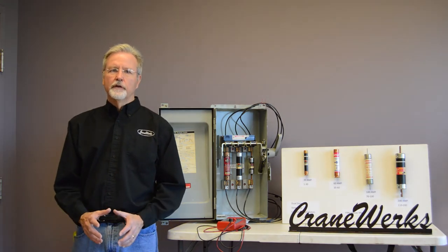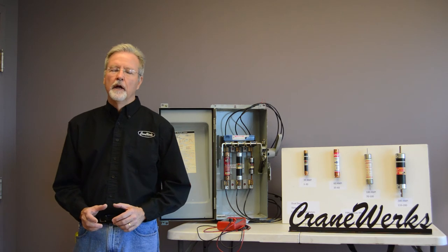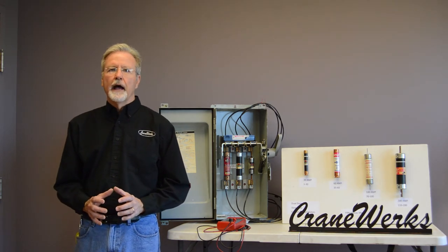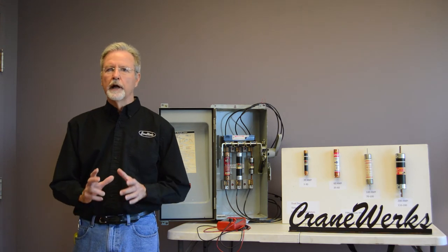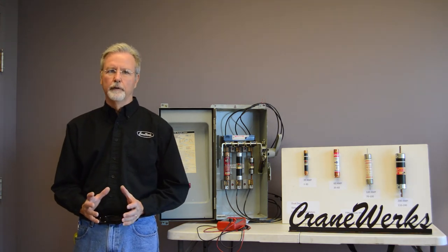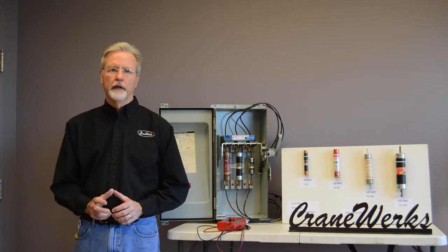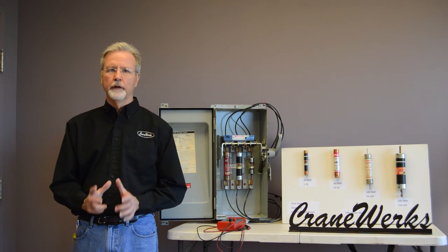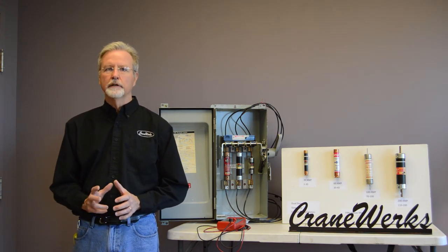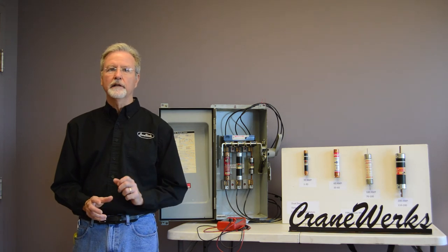One final note today to the CraneWerks Crane Rangers that are viewing this film. It's very important that if you go on site and discover a fuse blown, but you're not able to determine the reason that fuse failed, you will need to discuss this with the end user, your customer, and let them know that there must be some intermittent problem that caused that fuse to blow. And for you to troubleshoot that problem, it has to be present, and it isn't at this time.